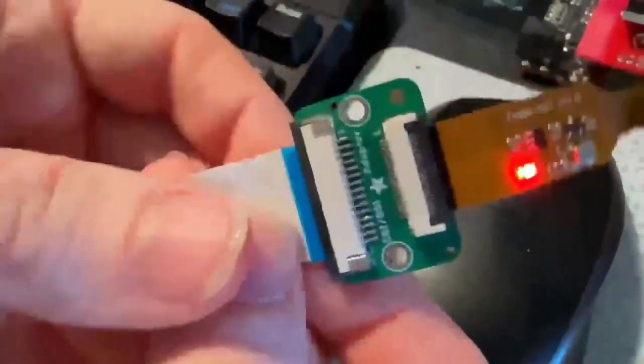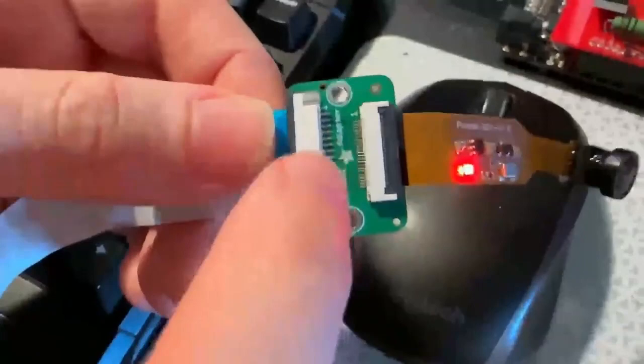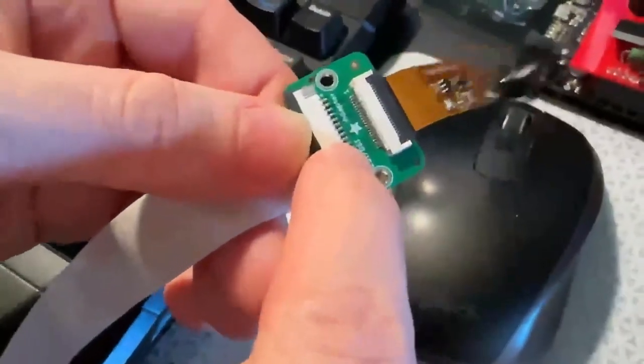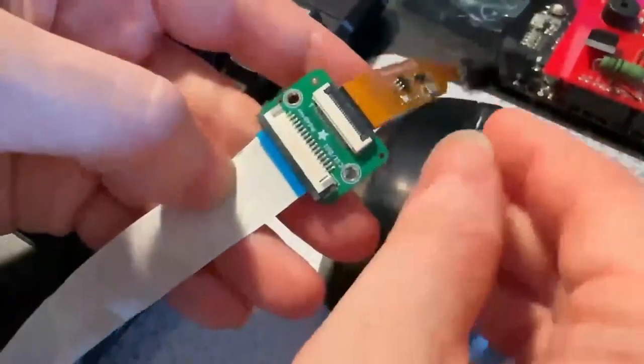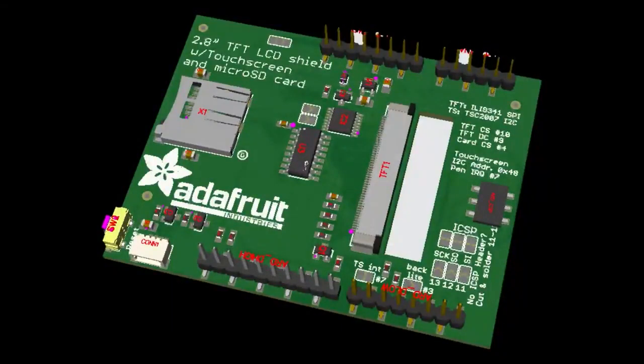Getting to some really old prototypes now. This is a CSI/DSI adapter that goes from the 22-pin 0.5mm pitch to the 15-pin 1mm pitch used on the Pi Zero and classic Raspberry Pi. I'm testing it with the Raspberry Pi on the camera port with a wide-angle spy camera. I'll run raspistill and you can see it's working — even shows inside the camera. It works with a nice long cable, all pins are working out. So I can design a tester for this and put it in the Adafruit shop. That's just stuff we had time to post — there's even more coming throughout the week.